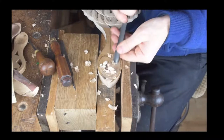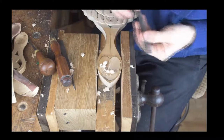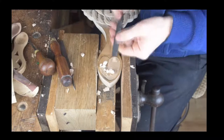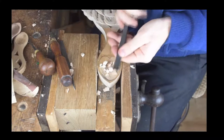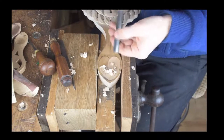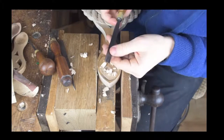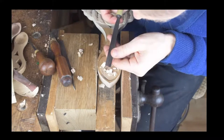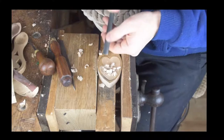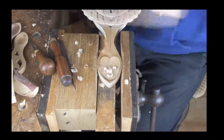We've got a few videos coming up on the tools, including one on a beginner's set. There are a few little lines just appearing on this one, so it's due for a sharpen — there must be a little feather edge nick. It's not going to cause too much of a problem because I'm going to sand it all out afterwards, but if I was doing really fine work I'd want to get those lines out. There's a tiny little nick in the blade — that can happen, especially if you're carving something like teak.